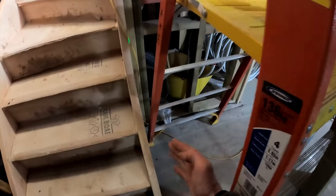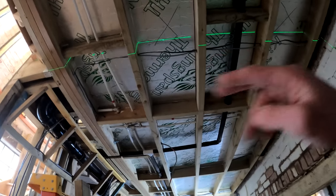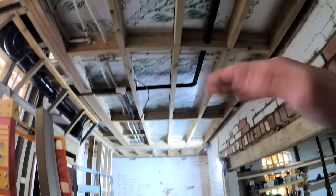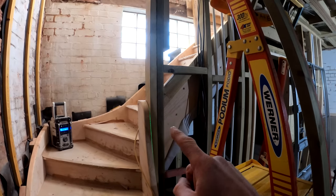So I've got my laser set up now, which will define where I fix the start of my stud work. Obviously the pocket door is going to sit against the string of the staircase, and then I need to build the stud around and across the top as well, just to obviously hold everything in place. So I've used Pete's nice Dewalt laser - got that set up, so now that shows me exactly where this top plate needs to go, and I can build a lot of frame off that. That will bring me down to the height of the pocket door, and then I need to put a timber there against the wall, and basically sit the pocket door system against that existing stud work. Just get it all levelled up and squared up and we're good to go.